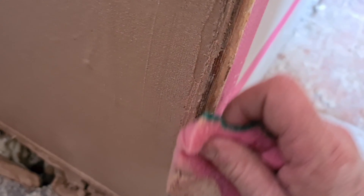Getting the plaster off the timber there — don't want it sticking to the timber. When it comes to flatting it off it'll just clean off nicely.